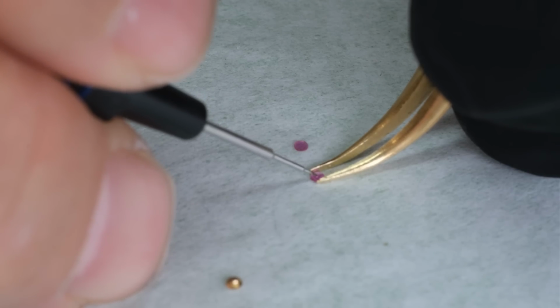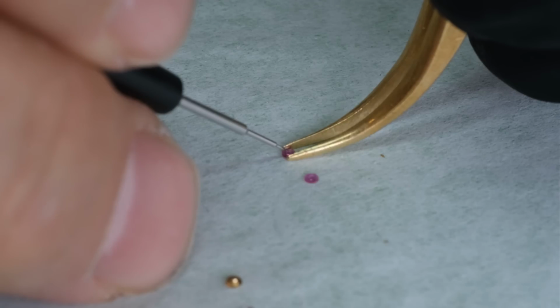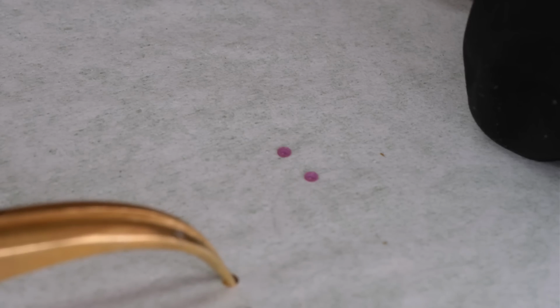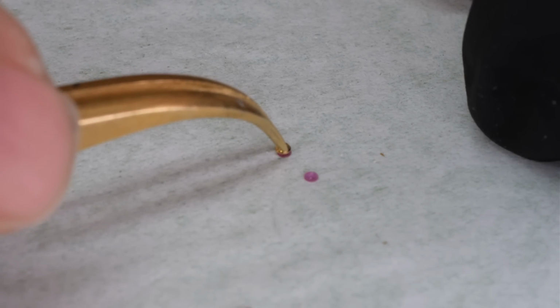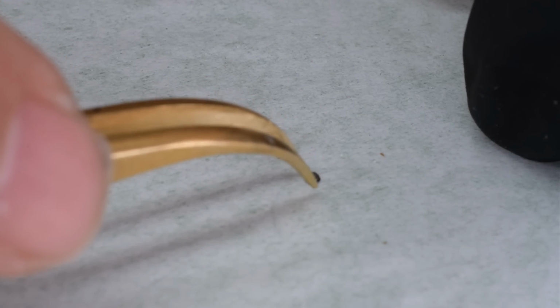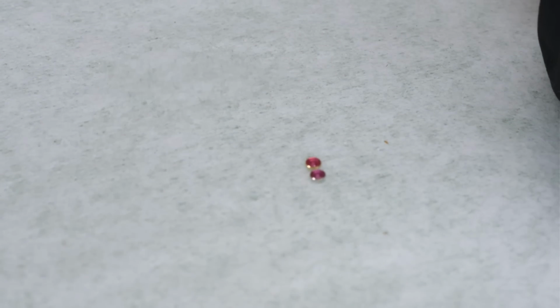We took out the jewels for the shock settings. And we're going to put a tiny little drop of light oil. This is where the pivots for the balance rest. So we'll make sure the friction is minimal. Yeah, what did I say there? Did I say minimum or minimal? Should be minimal.